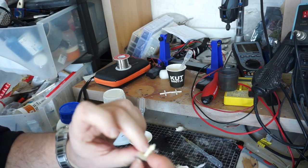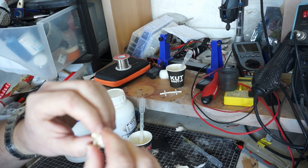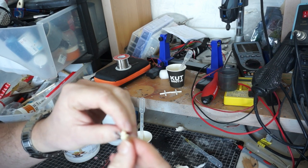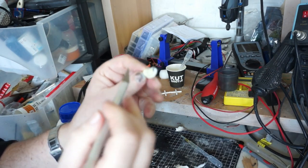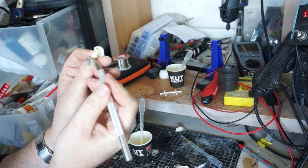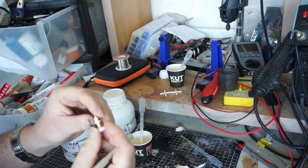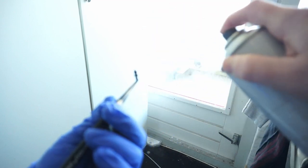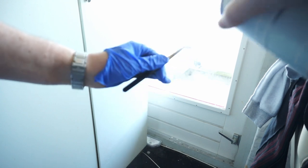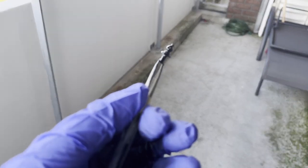An hour later — look at that. Yes, we've got the tip! And there's flashing — we'll cut that off later. I just first squeeze it down so I have a nice line to cut. We did catch a tiny bubble in the visor, but we expected that. And a tiny bubble on the collar — we can cut that one off. Usually a bubble is an indent, but this is actually a barnacle. So we cut it off. It is very easy to cut when it's still not fully cured. I didn't have black pigment, so I have to spray them. This is the second coat. And then the satin clear coat when everything is dry. And it will look like this — a nice copy of the bishop. We now have a complete working chess set. Awesome.